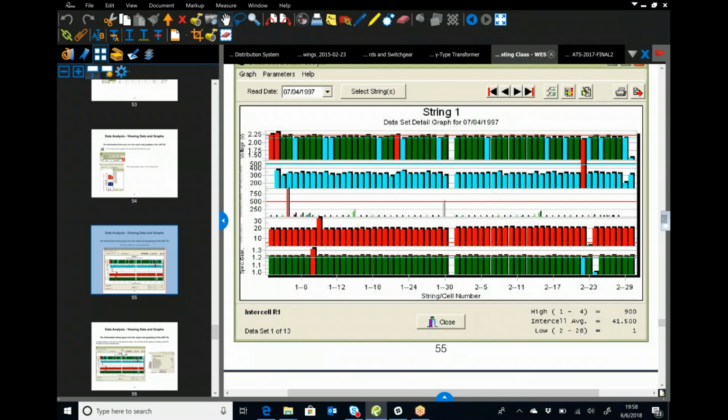Okay, so when you're doing these resistance tests, you're moving one positive to the next battery, moving one at a time to get those resistance checks. You're not keeping one at the first and progressively moving down, because you'll trip that over voltage that you're talking about. Correct. You'll do individual jars.